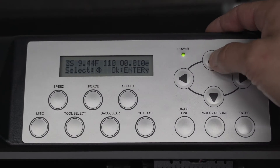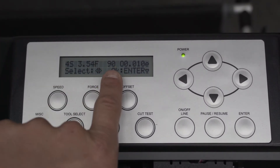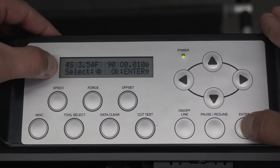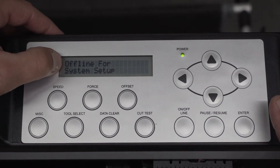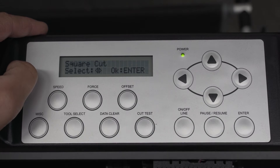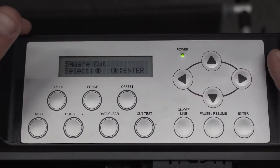So right here you can see we have 4 tools. Pick one you want — say we're going to be on tool 4. This is 90 grams right now. 90 is super high, guys — you do not want to start there. You probably want to start at like 10 or 15. So we will go back, select this tool, enter on that. Now we're going to click on tool 4's settings — you can see we're at 90 — and take it all the way down to 10. Click enter. Now you're on the offline setup still, so click cut test, then click enter. This will give you a circle with an arrow in it. What you want to see is if it cuts through the material but not all the way through the backing. You just want to cut the top material, not the backing paper. Do this multiple times until you get a clean cut — everything pulls off cleanly without cutting through the backing. Keep adjusting the force; it does take time to figure out.